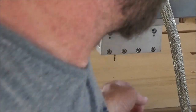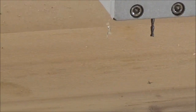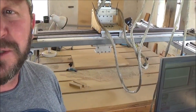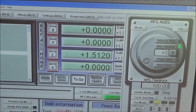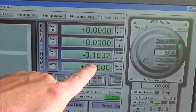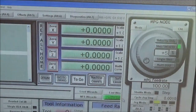You can see I've changed bits out — there's a little end mill bit I put on there. What I need to do is make it hit that same X that's right down below it. My X and Y are still going to stay the same — the only thing I'm changing is my Z, the depth it goes. So I lower it down, touch the X, and zero Z. You can see my Z moving. I lower it down until it touches the top of the material — it's 0.16 different than what the V-bit was. I just hit zero, and now this is zeroed. It's at exactly the right spot and we can take off.